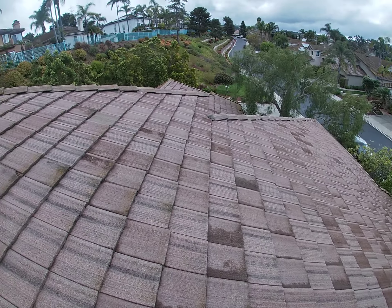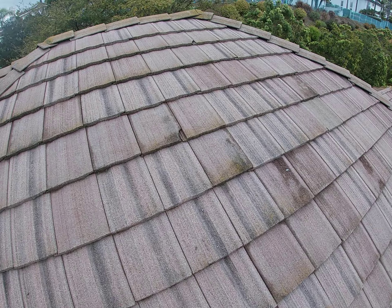Concrete tile roof, general condition. It seems to be in decent shape on the tiles, other than you've got some cracks like that. That's getting to the point where that one might need to be repaired. Four inches is where we want to start taking them out and replacing them.